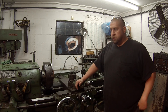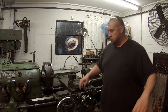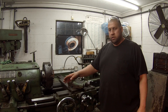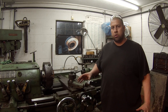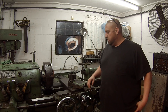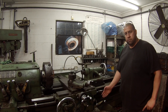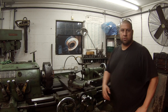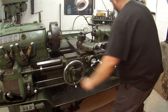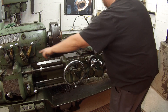So I looked at the pictures and that's pretty evident — that's what's missing is the shaft itself, which is this shaft here. I've never really gone into discussion on how this works, so we're just going to do a real quick video so that Rick can see, and Tom and whoever else is interested, how the lead screw reverse lever works. You've got a lever right here — this is the shaft that is missing on Rick's lathe, and it goes all the way through the apron here on each side.